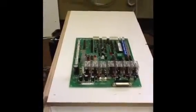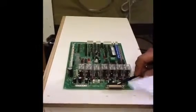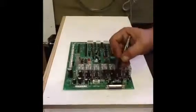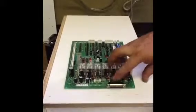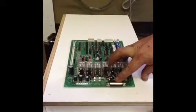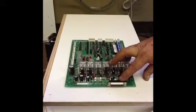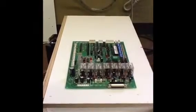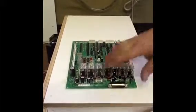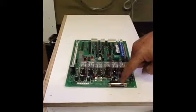On the main board, I'm going to start with the connectors. This first connection right here is your J1 connector. J1 has got nuts on each side — that's where your claw gantry harness comes down and plugs in. On most recent machines, it's going to be a gray connector with a metal case around it that plugs in and screws on. If you're having problems with the machine, first check that connector and make sure it is seated where it belongs.